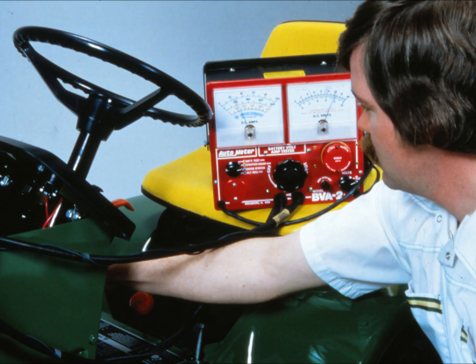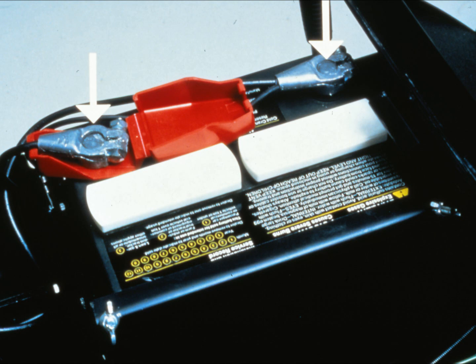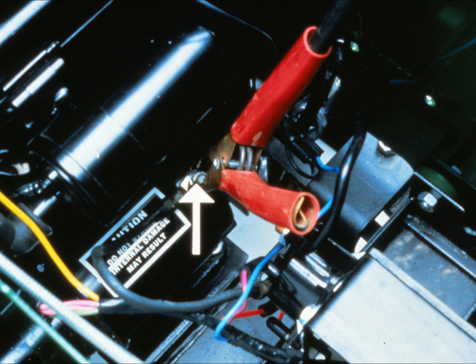In steps six and seven you work out a plan of attack and then execute it. The first thing to check is the battery — use a voltmeter to see if the battery's voltage falls between 11.5 to 12.6 volts. If not, the battery should be charged before you try anything else. Check the battery terminals and the connection at the starter terminal to see if they are tight, and don't forget the ground connections — the other half of the circuit is the ground.